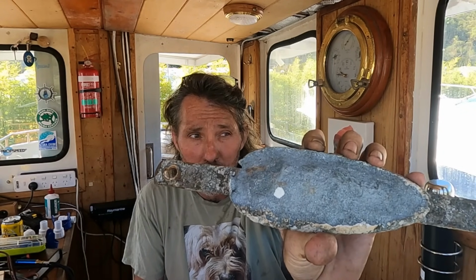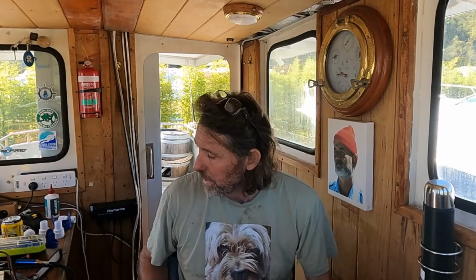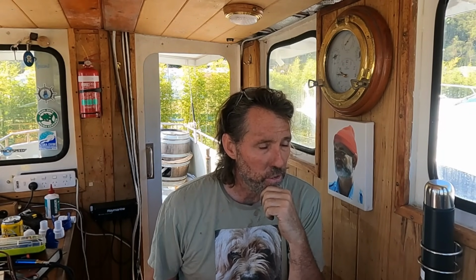Gotta say though, these were put on originally, so they're 4 or 5 years old. It's good they're getting eaten away, it means they're working, they're not isolated, not doing their job, but definitely due for replacement. Also, I originally did a bit of an experiment I'd forgotten about, where one set I welded on, one set I think I welded the bolts to the boat. One set I just put them on, the other set I put them on with conductive grease on the bolts. It's interesting, I don't know if I can read anything from it, but all the ones that were bolted on are eaten like that. The ones that are welded on are not very badly eaten at all.